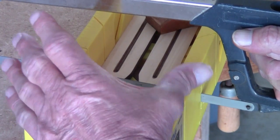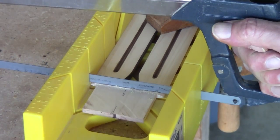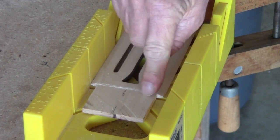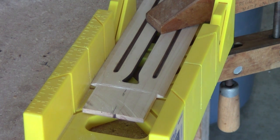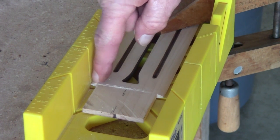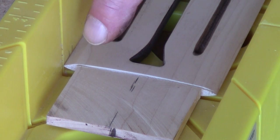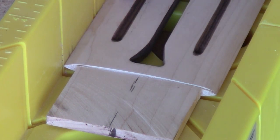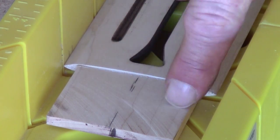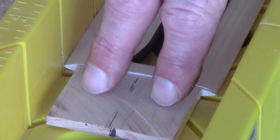I'm barely rocking this because this side is not totally flat. I don't want to go very deep at all. Then you want to take a chisel and just barely knock out that section. From this point it's straight from end to end — so flip it over, match it up, and do the same thing. I got both sides done and we've got a true 90 degrees on both sides. Next step is to find the center of my piece of stock so I can drill it out to insert the blade tang.